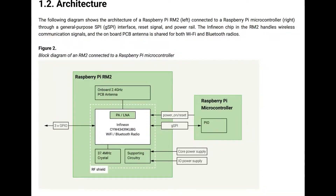If you want to use this module, there aren't a lot of pins on it. It basically uses SPI, power, and a couple of signal pins to connect to a microcontroller — or even a microcomputer. There are drivers available for the CYW43439, though for now I'll be talking mostly about microcontrollers.